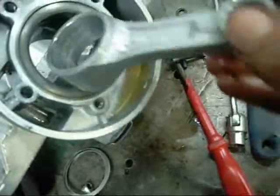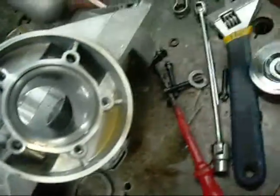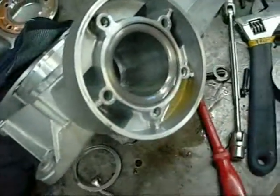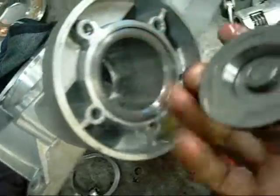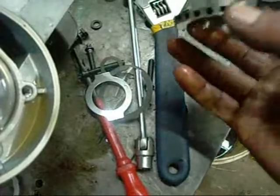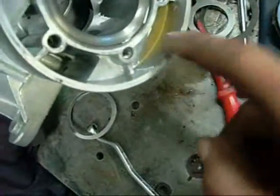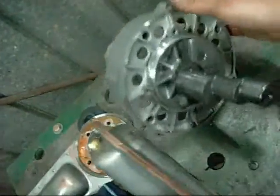It's just heated. The big ends are a bit scored out — not too bad though. Bores are perfect. They're a steel liner, pressed in tight. The reed valves — discharge there and suction in there. Suction is coming in through here past the motor. Clean oil. Rotor is still smoking hot — it's turned into an induction heater. The windings are burnt out.